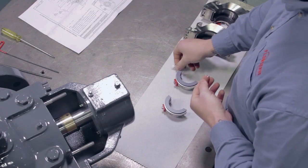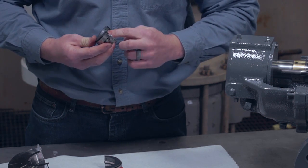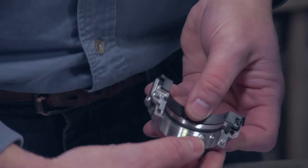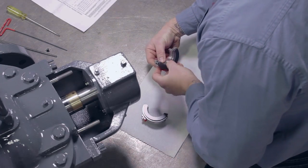To install the seal drive, first lubricate all the exposed surfaces of the sleeve gasket, rotating face gasket ends, and seal drive split joint gaskets with the enclosed lubricant. Next, confirm that the set screws are backed out of the seal drive bore so they do not interfere with the fit of the seal drive around the shaft.